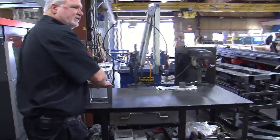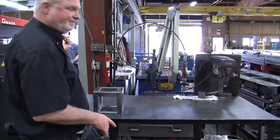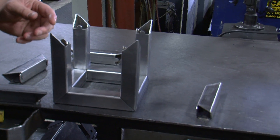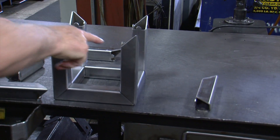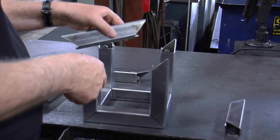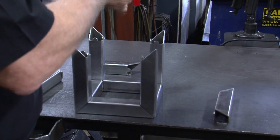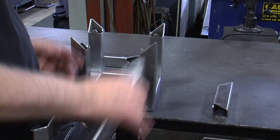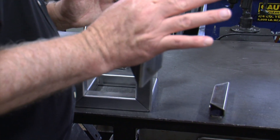You can't do it with something like this because it interlocks one way. You can only do this with this kind of laser. Because I'm rotating the tube and I can cut under rotation, I can make male-females that interlock in. Now when I weld that, I don't even need to jig it, and the integrity of the part is good enough.